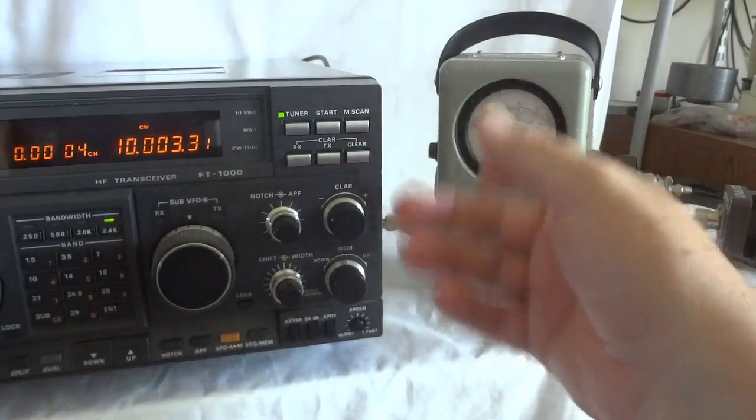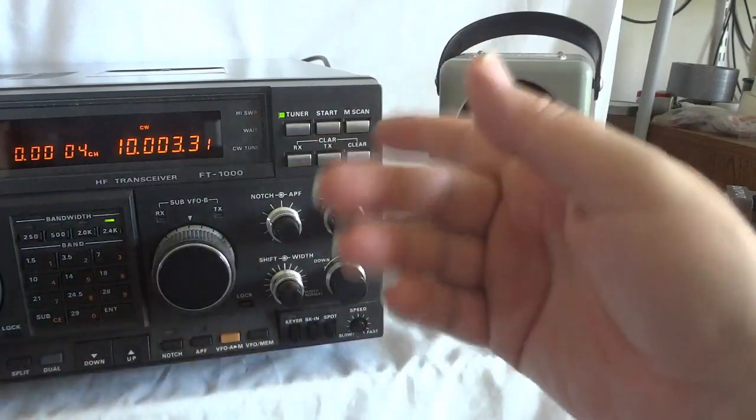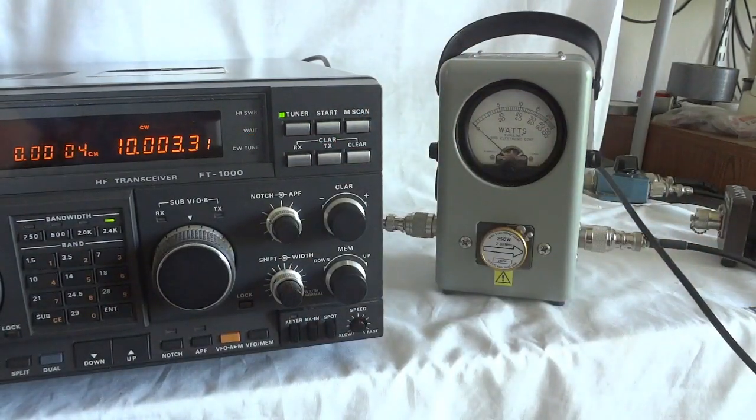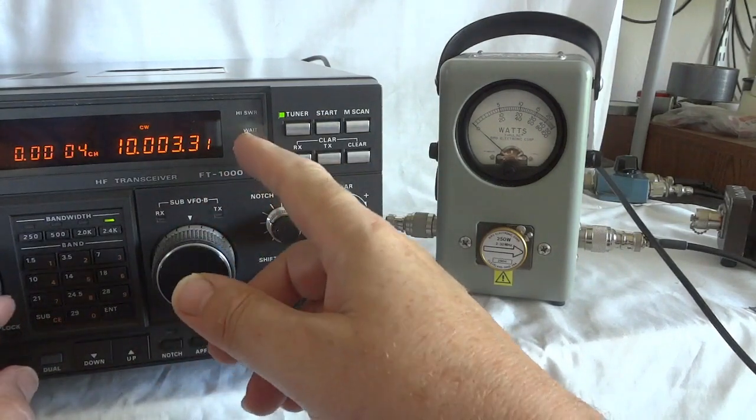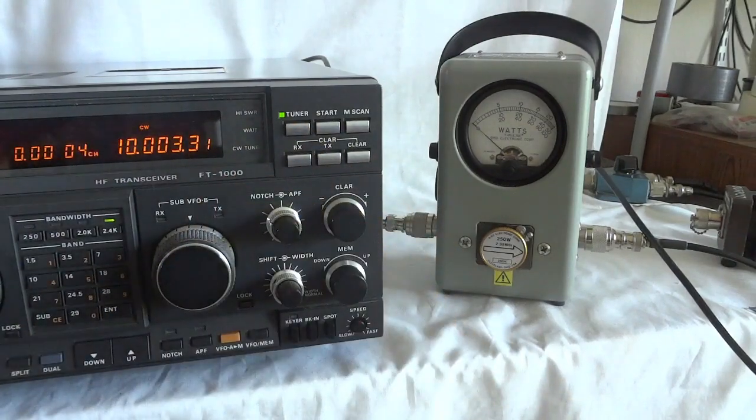So the auto tuner basically quickly tests for a good SWR, it sets that there, and then it will remember that. So if I go to another frequency, or slightly different frequency in this case, then it will retune that again. And as you see, wait, it says, that means it automatically calculates what it should be in between those points. So it's an intelligent tuner that's in there, and it can deal with SWRs as bad as 3.0. Don't go above it, then the voltages get too high. But 3.0, which is for most antennas that are not optimal, you can easily correct.